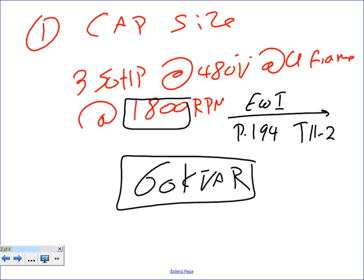That's how we find the kW, right? All you need is the efficiency. If you know the efficiency of the motor, you find the kW, then you continue doing the same example that we did before. We're not going to do that. Directly from the table, we're going to find 60. Any question on how we found 60?